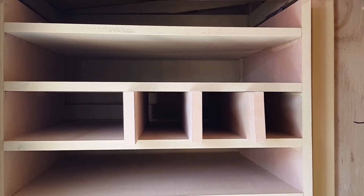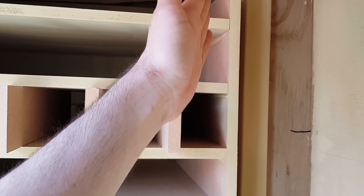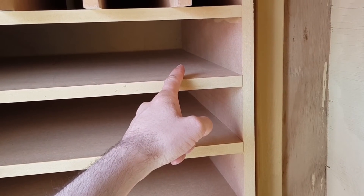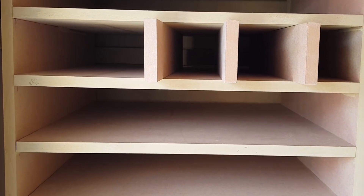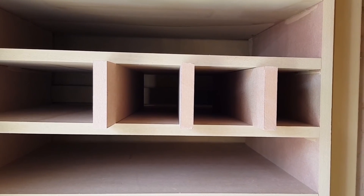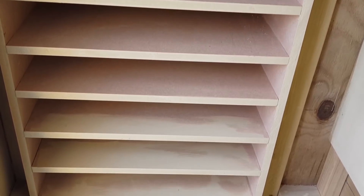It's absolutely crazy how much you can fit — 50kWh in such a small space. I potentially wouldn't put 50kWh in, but you can definitely do so. One row all the way down to the floor, with 80p backwards to the back — you can fit probably 95p, but let's say 80p. That's 10kWh down, 10kWh down, 10kWh down, 10kWh down — five sets of that. It's a very tight fit, but it's definitely achievable. That's one of the big advantages of using a vertical or horizontal rack.